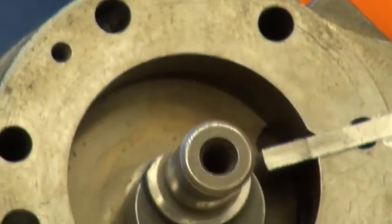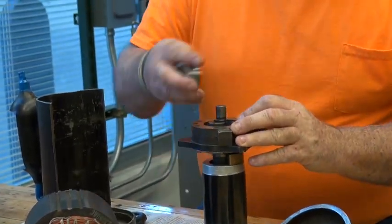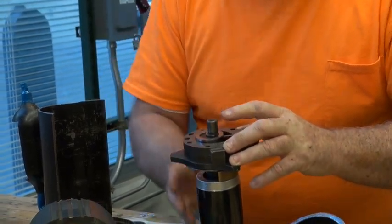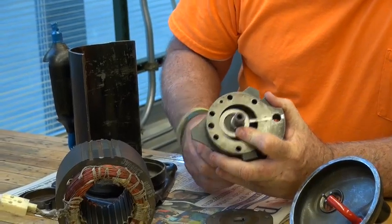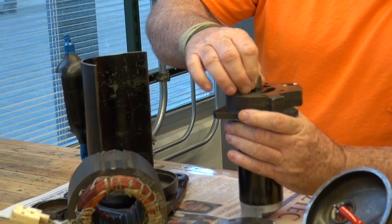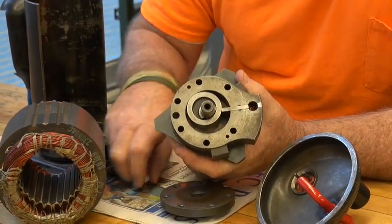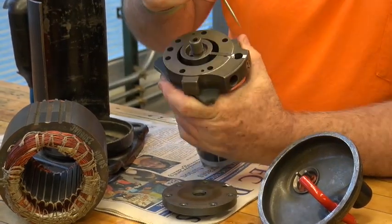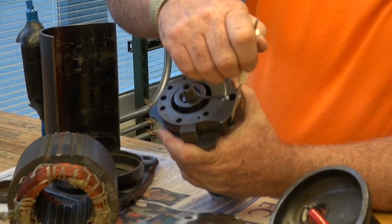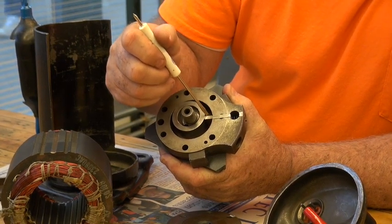And it's only on the high side. Now, let's go over this one more time to understand the refrigerant flow. It goes into the low side, comes into the compressor right here as a low-pressure, low-temperature, superheated gas. You notice that the low side and the high side are separated by this spring-loaded piece of metal right here.